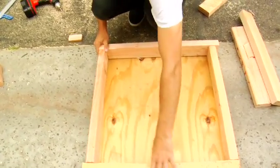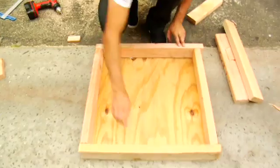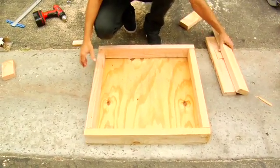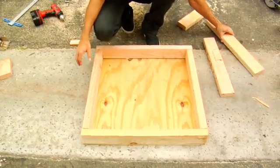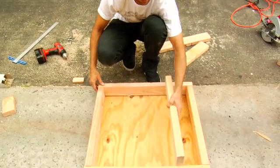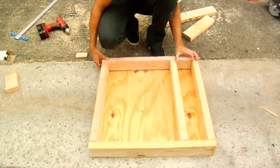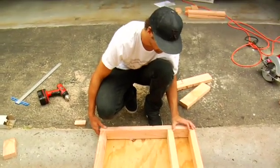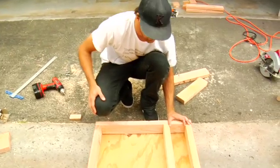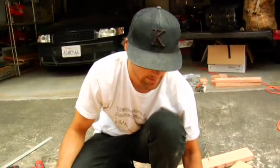We are going 2 27-inch pieces at the end here, 2 24 pieces right here, and for added support, you can cut some more 2-foot pieces. They'll fit here in the middle, and if you place them just a little bit wider, 3.5 inches, the exact width of a 2x4, it'll lock the 2x4 in place and hopefully keep it from shifting around a little bit.